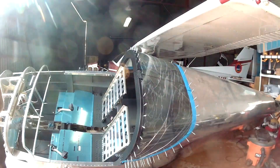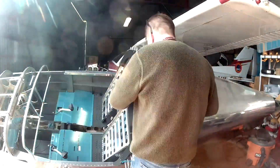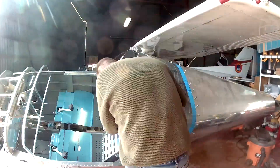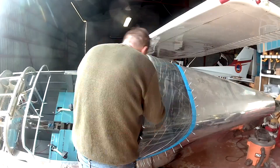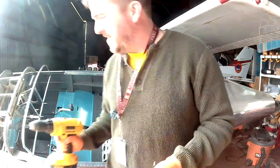The rear holes where the rear window meets the tail cone are actually just held in with screws, washers, and nylock nuts, which will be put in much later — as well as some sealant. We're going to put tank sealant or RTV or something like that around the entire perimeter of the window when it's fully installed, which won't be now, it'll be much later.